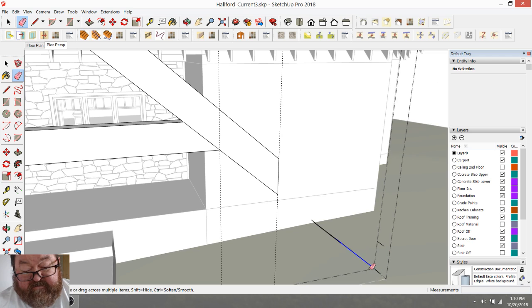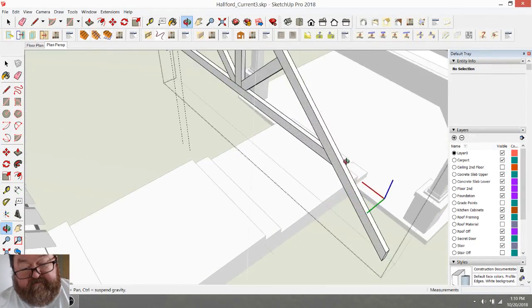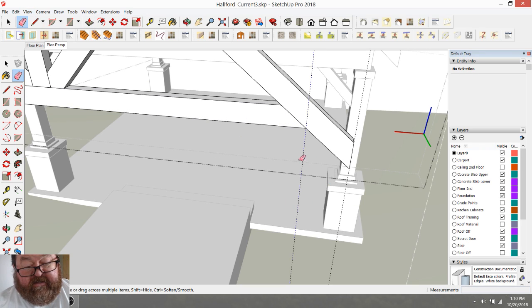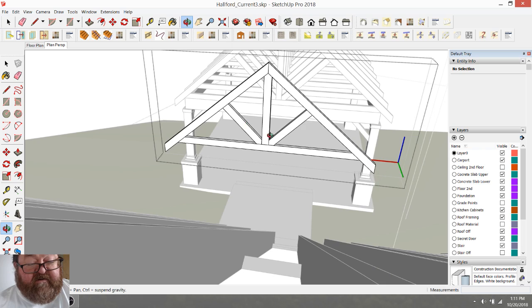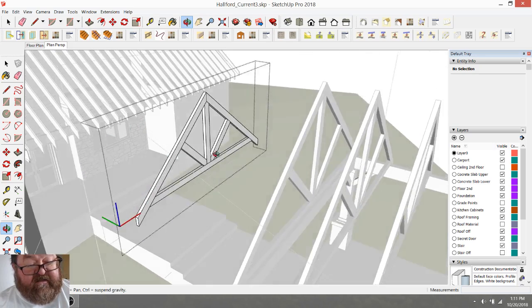And there's that mess where I had some non-coplanar junk, but I'm slowly fixing it, turning it into a nice truss. Myself a vertical edge right there, 16 is a nice overhang. It's just enough where you get good protection for your stuff below. It's going to protect your siding and post and trim and all that, but it doesn't hang down so far as to come into your windows and stuff on your house, that kind of thing. So it works out pretty good.